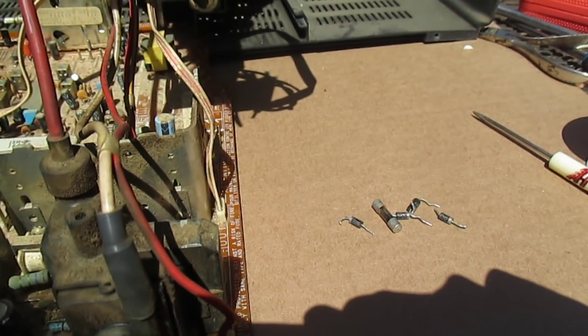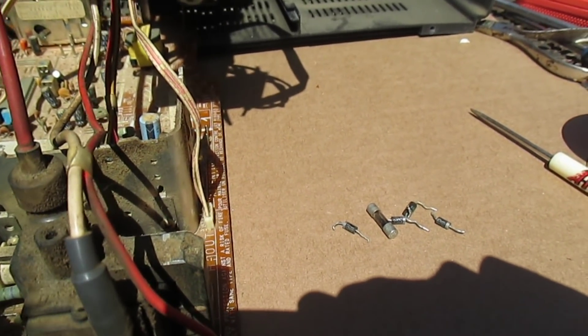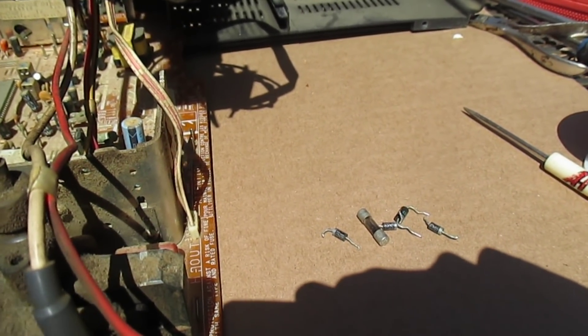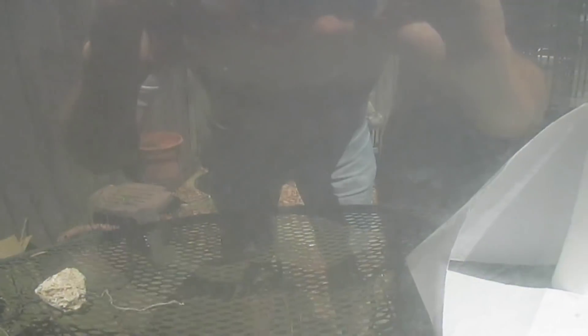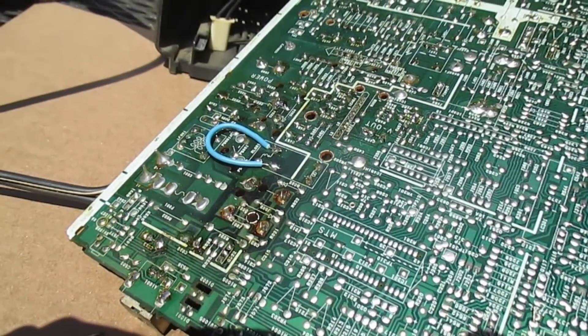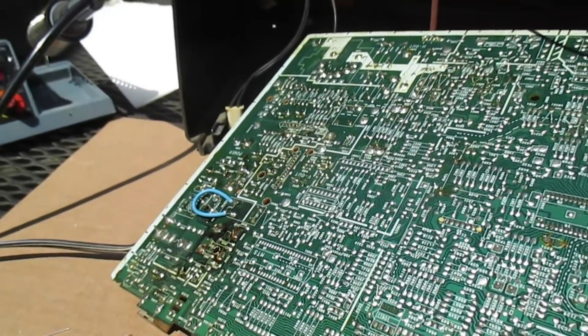There are the four old diodes and the blown 4-amp 125-volt fuse. Only one checked shorted, but from experience with one shorted you'd better change all four. We've replaced them all. Now I need to round up a fuse and we'll try it again. We now have high voltage and a raster — that's a good sign. Let's see if the relay will click when I push the button, remembering that we still have the contacts jumpered. The relay is just chattering — it's not getting enough voltage to stay in.